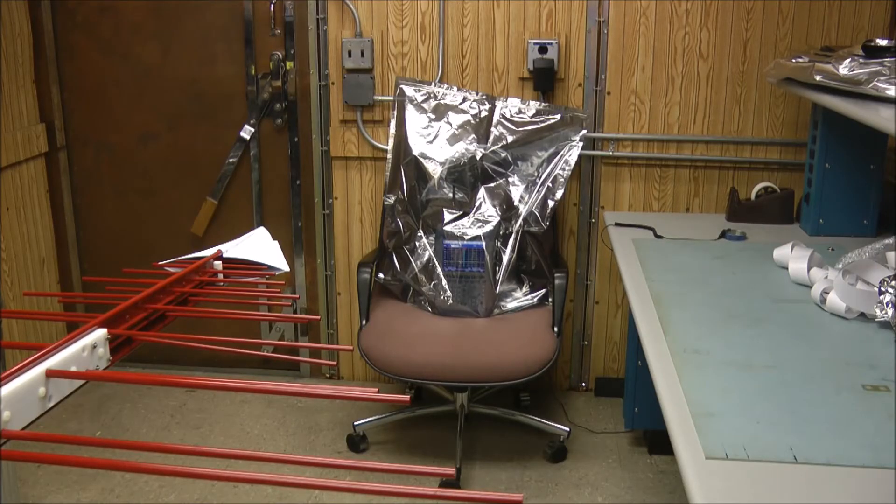My next experiment, I want to test out one of these anti-static bags. I have several here — I probably have a dozen different types. This one is not a high-performing bag, but it is fairly translucent, so you can actually see the signal inside the bag, which is really kind of neat. Most of the others are not, and so you have to pull out the spectrum analyzer to see it.